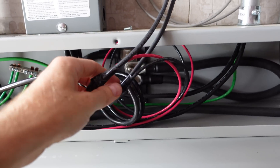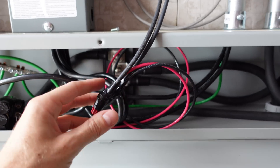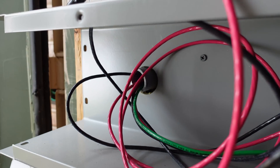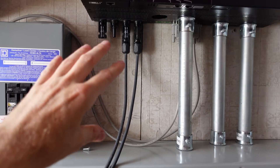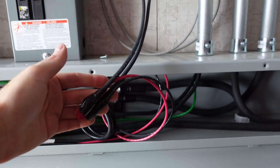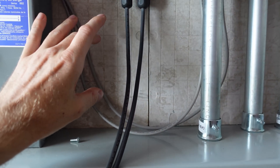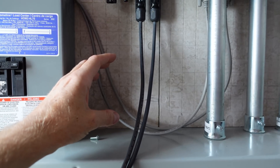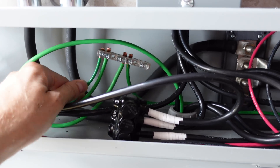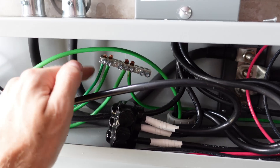You can see some rather crude wiring here for the PV input — I do have two arrays connected, one going to each inverter, and the wiring is done this way temporarily. This is some 10 gauge THWN coming off of the combiner boxes, entering the wireway on the left. I do want to put a disconnect here between the wireway and the input using midget style fuses rated for PV — I want something with an actual PV rating and hopefully UL listed. My grounding connection is down here in the back; everything is bonded except for this wireway, which needs to be bonded directly to this lug — something I need to work on as soon as possible.